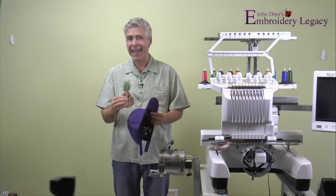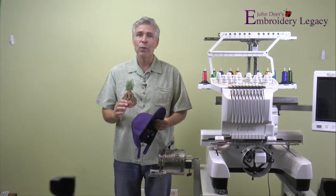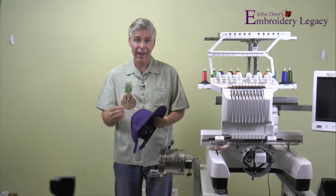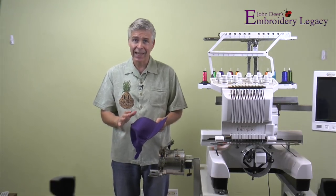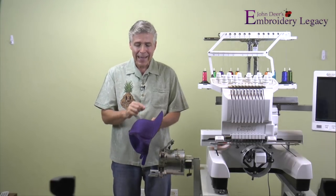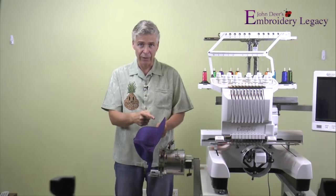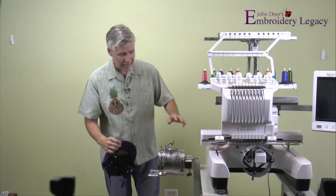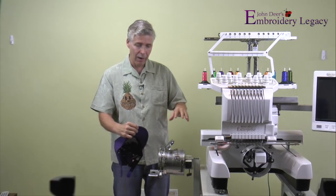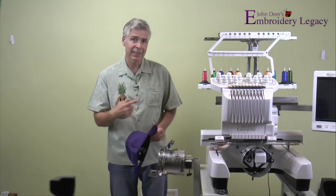But if you're embroidering on a multi-head machine, it's a totally different story. We actually had 136 multi-heads running in a factory back in the 80s and 90s, with 18-head machines running finish hats — literally hooping 18 hats at the same time. The center seam had to be perfect on every single hat. So if you do have a multi-head machine, I suggest investing in crosshair lasers on your cap jig. We had them rigged up on our jigs so I could always tell if I was centered to the seam, getting consistent hooping every single time.